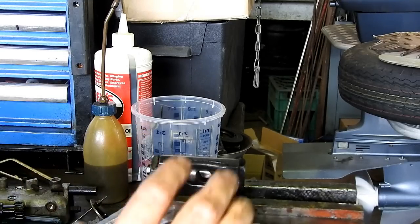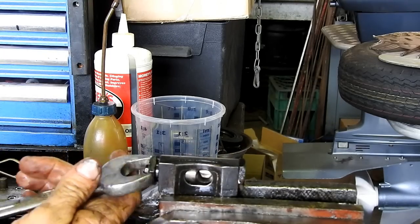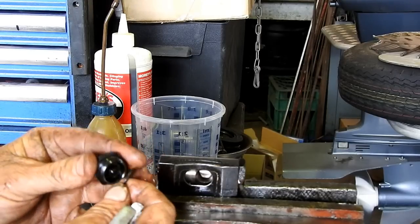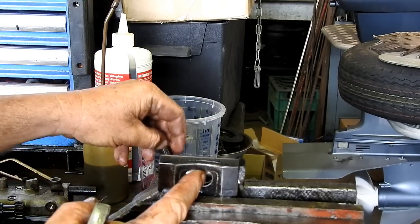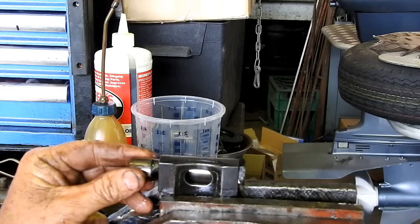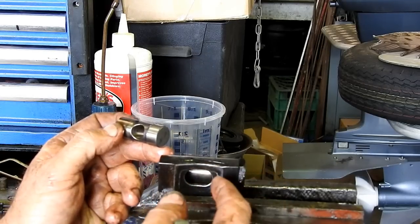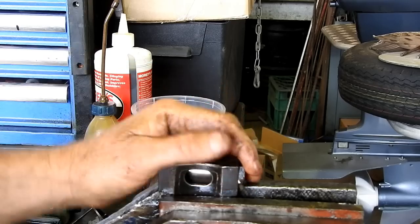I don't do many of these particular pumps. I wonder why there's a lot of 23Cs around. There's an O-ring on the fitting. And we have a spring that holds pressure against this plunger. So yeah, depending on the fuel pressure, it works against the end of the spring, and that decides if they'd like to advance the pump or not.